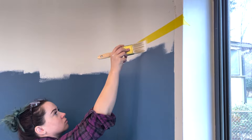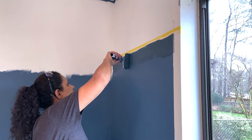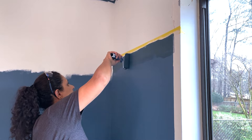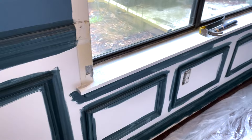There are actually several different methods to try and get a nice crisp paint line using painter's tape, and this is just one of the options. My walls are nice and flat, so I find using the existing wall color to seal the tape and then the new wall color on top prevents bleed through. But other methods may be more effective with textured walls, such as caulk. I've considered doing a video comparing the different known methods, so if this is of interest to you, let me know in the comments.